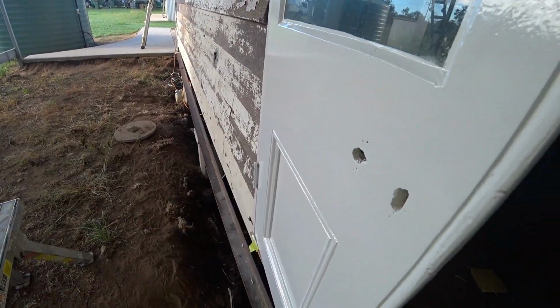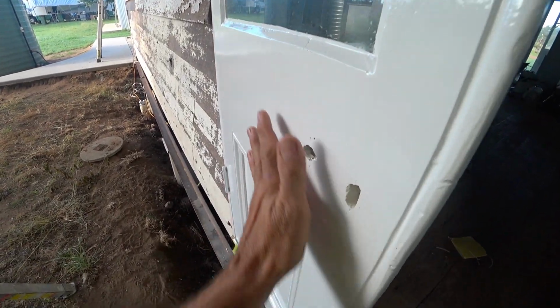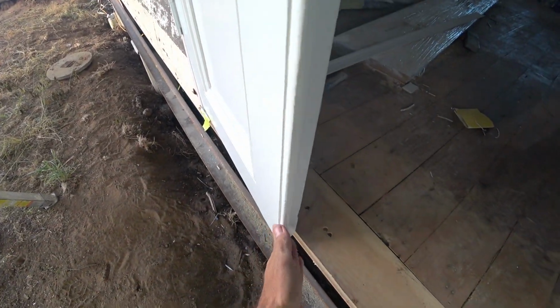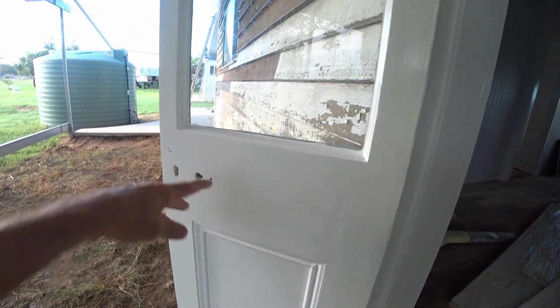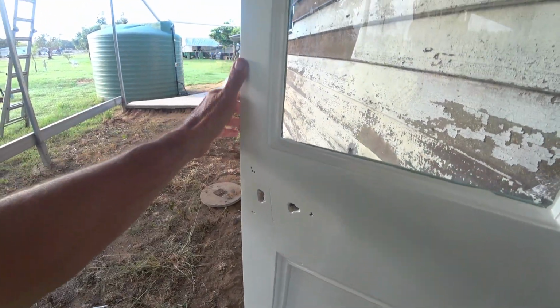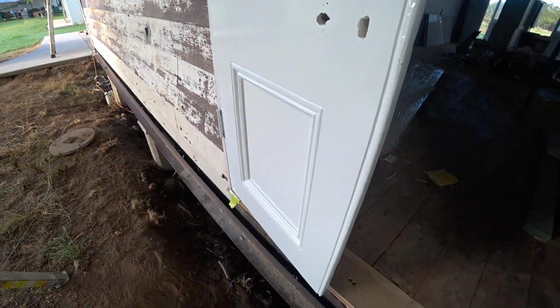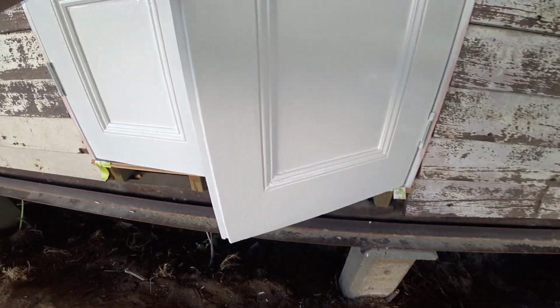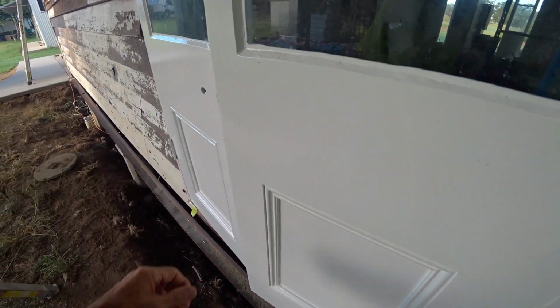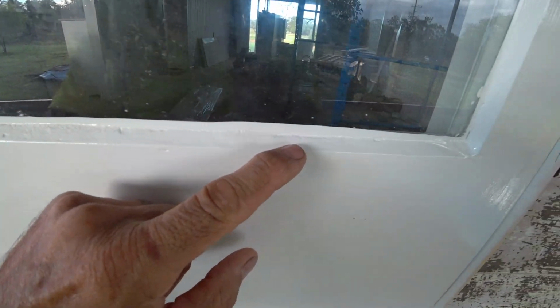And this is why. But remember, this is only one coat of the oil-based gloss enamel. Only one coat. And if we were to give that another, it's so smooth. You know, because of the system I did, it's just very, very smooth. We could put all the fittings and that stuff back on there. A lot of these things here obviously are underneath the door handle and stuff. But I didn't actually show you how much I dug these out. But that's it. That's oil-based gloss enamel, and this is what it does over putty.